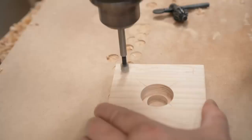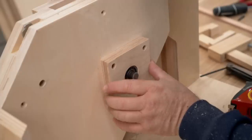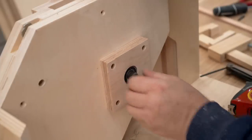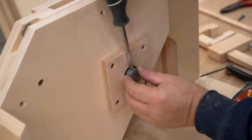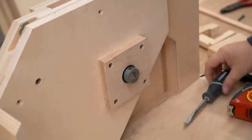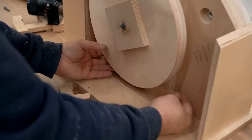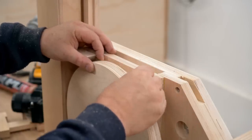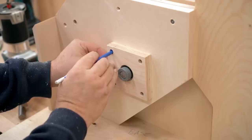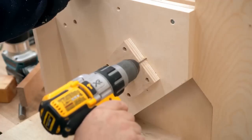You need to be able to move this block around so you can adjust the alignment on the lower wheel, so I'm drilling oversized holes for the mounting screws. What I'm doing here is trying to get the lower wheel lined up — I've cut wooden strips that fit tightly behind the lower wheel, and that will position it parallel to the frame while I mark and drill the holes for the bearing block on the back and get that screwed in place.